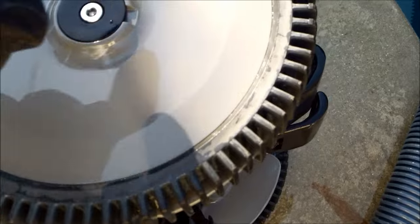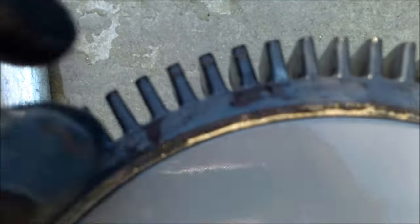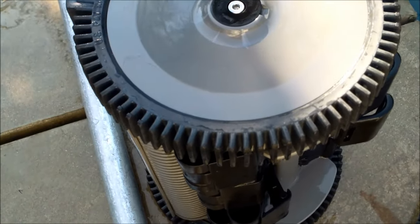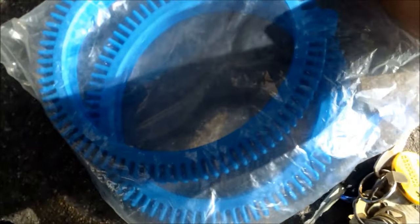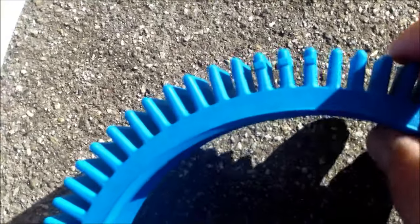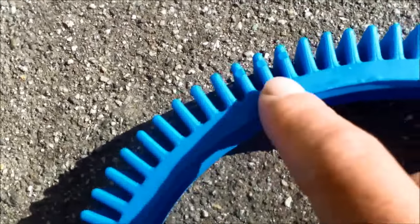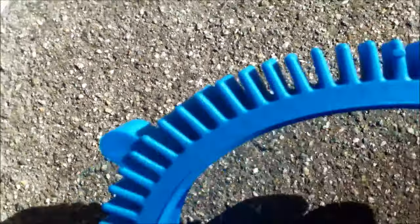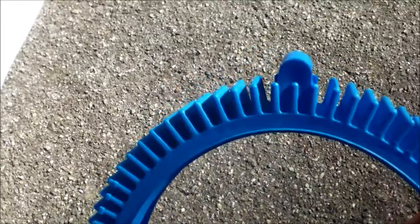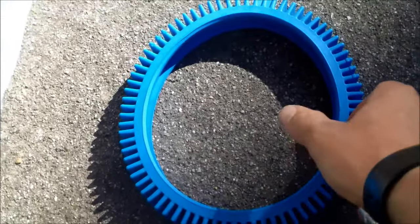The main thing with these cleaners is you have to change the tires when the wear line gets down. You can see wear lines on the tire; here's a brand new set to show what you're looking for — small dashes. When the rubber wears below those dashes, change the tires. The super hump tires go in the front. The four wheel model has separate tires without the hump for the back, while the two wheel model comes with super hump tires standard.